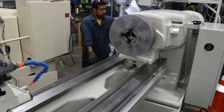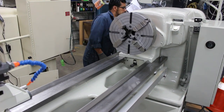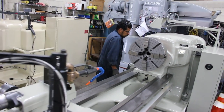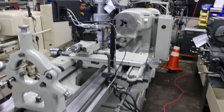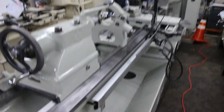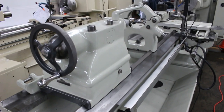We'll do a total of about six spindle speed changes. This machine has a tremendous amount of threads. That's 158 RPM. I'd like to point out that the taper attachment also has the bed clamp for it, right here. There's also a digital readout scale on the back.